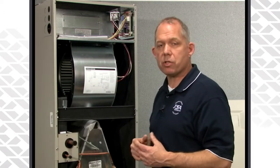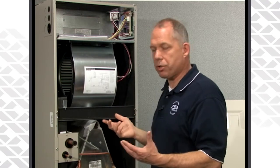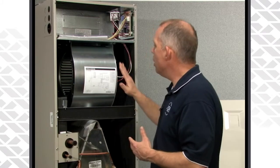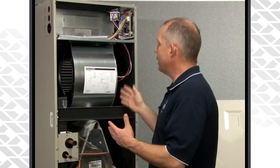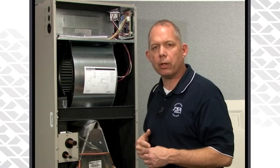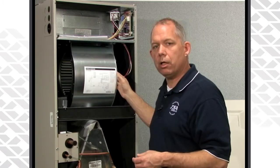You may have to make adjustments based on your duct system and static pressure, and you may have to make some adjustments to the blower speed from there. We do not set the blower speeds for your particular install — you must set that and double check it. This is a good time to do it when you've got the system on the vacuum pump and you're pumping down the system, so go ahead and set that speed now.